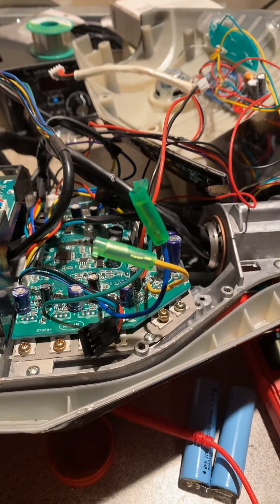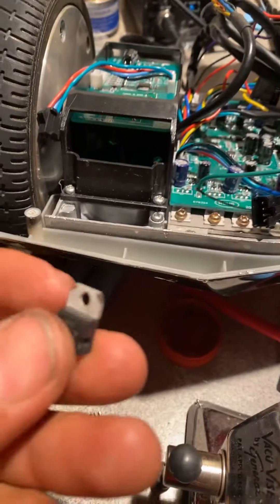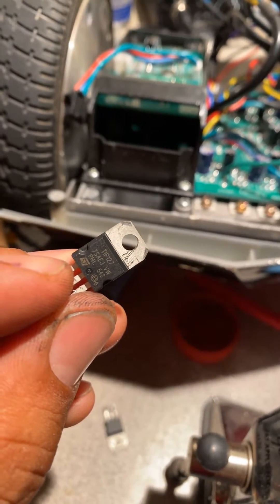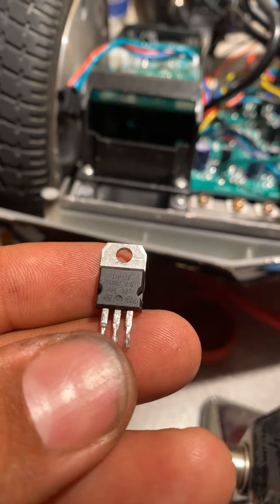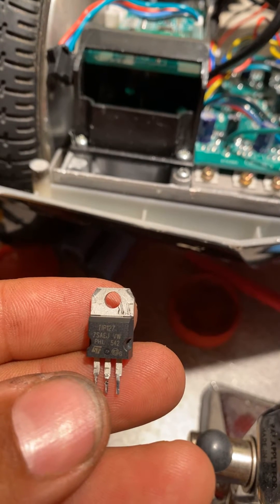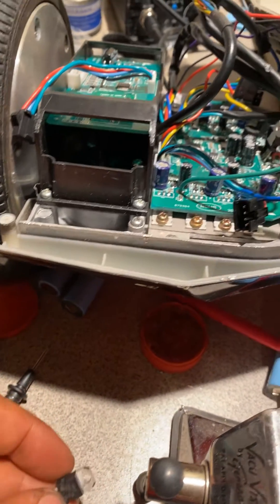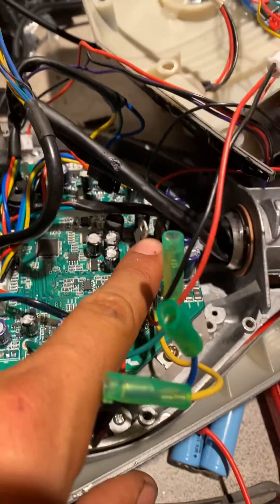What you should do if your power board won't turn off: get these transistors, TIP127. It has some different numbers - this one has 537, the other has 542. So the bottom numbers are different. You can probably figure out which one it is, but in my case I just swapped them.